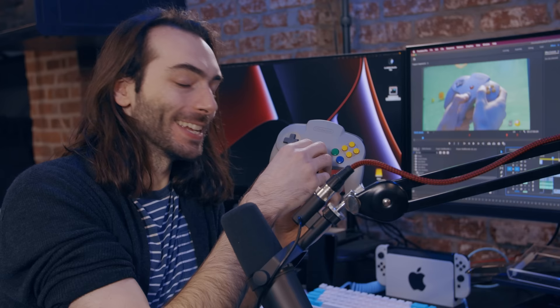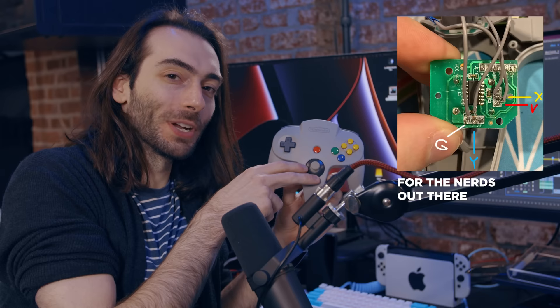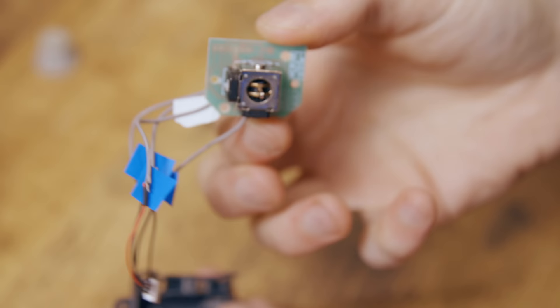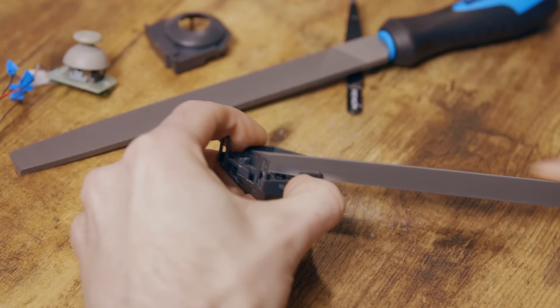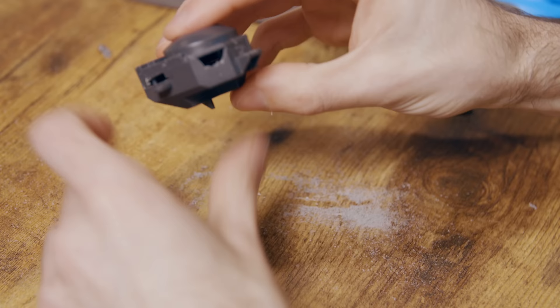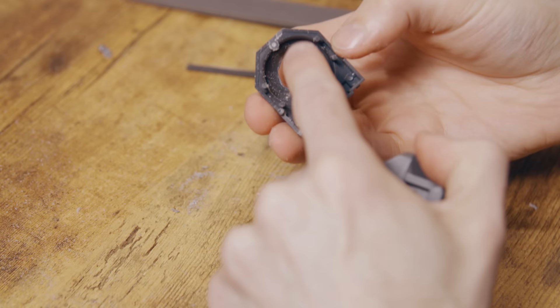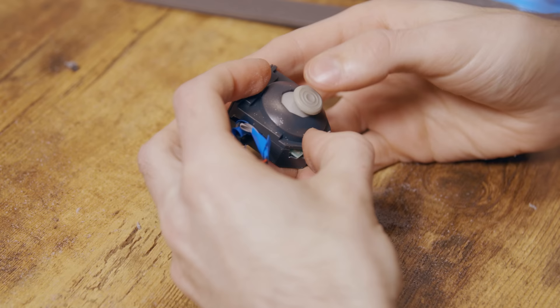This has a bit of a happy ending because I did it — it's very janky, but we got it to work. To make the x-axis not flipped, that potentiometer has to be on the top. What we did was rotate the entire board of the thumbstick and then switch the x and y axis — that way the potentiometer for the x-axis can be on the top and the y-axis stays basically where it was. The problem then was getting the board to fit in the case, which took a lot of filing. I filed the spot for the cables, filed the bottom left for the board to stick out, and filed off one of the screw prong things.